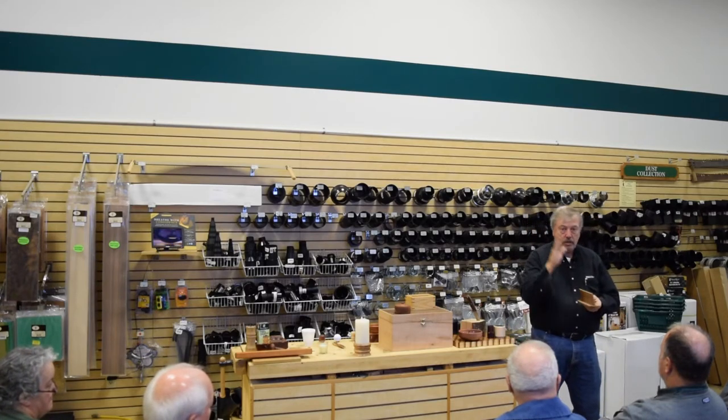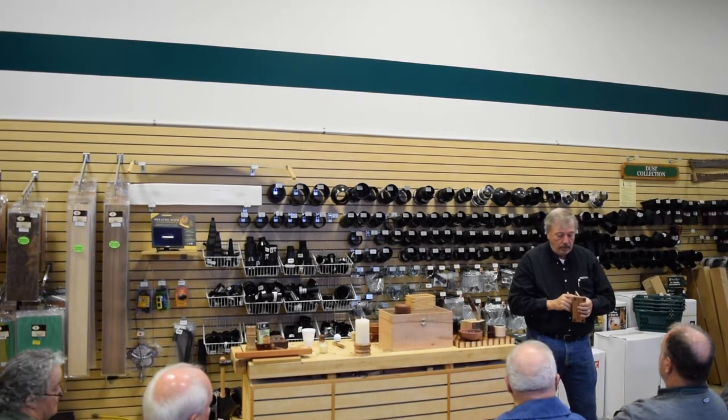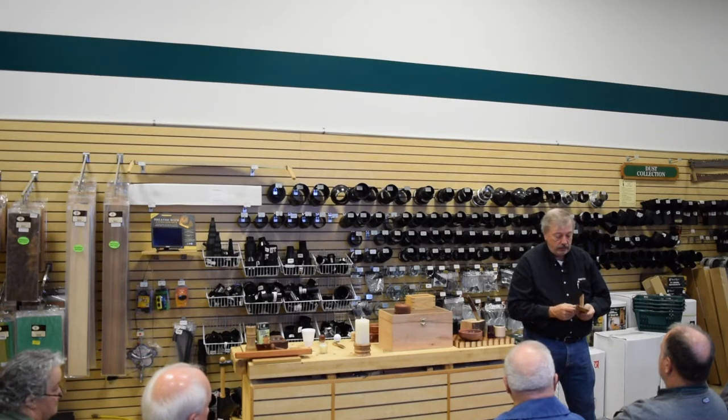But here, table saw, 17 degrees. You need a type of blade that's going to give you a flat bottom. And you can do two cuts with this. I just did two dado blades together to give me a quarter inch. So this is a quarter inch cut. So these are quarter inch right here. But anyway, that's it. The wood. My granddaughter got that, wrote her name on here so I wouldn't forget about it.